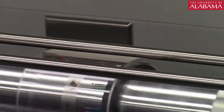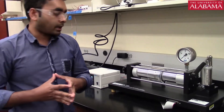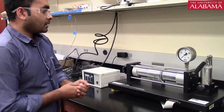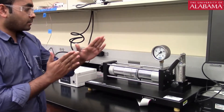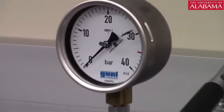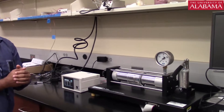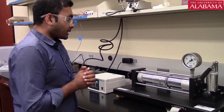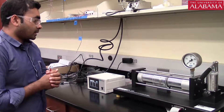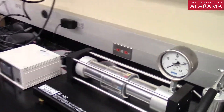That is how we take the data. In the lab handout, we have to increase the pressure starting from zero bar to a maximum of 30 bar — do not exceed 30 bar, as that is the cutoff to maintain elasticity. We don't want to cross the elastic limit. For each pressure step, record whatever strains we have. We will check linearity: as pressure increases, strains should increase. Also, the strain values at different gauge angles should be different.